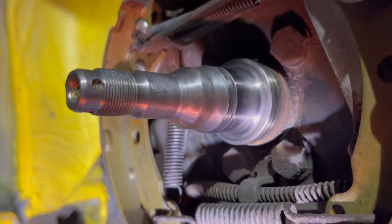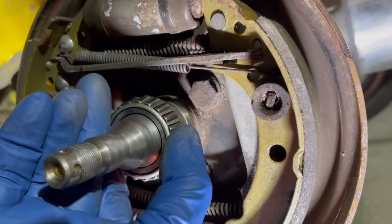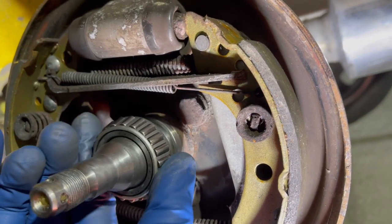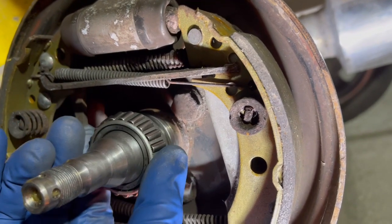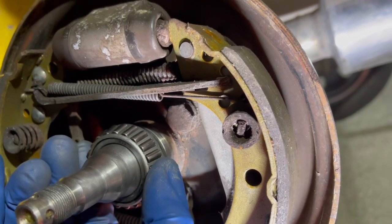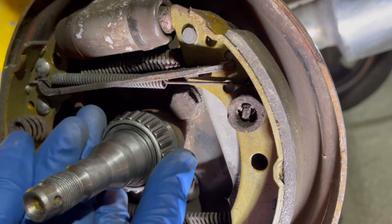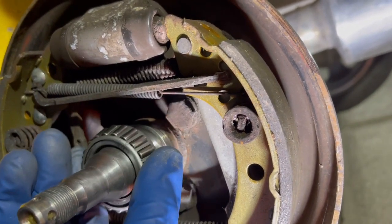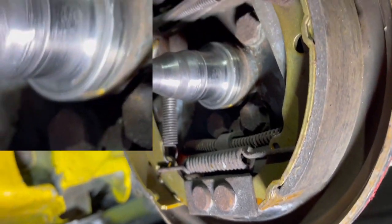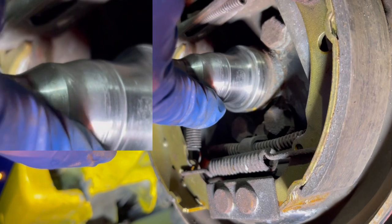It's pretty fine grit so it's not taking off a lot, but it's polishing the surface. We're just about there. It's dragging a little bit just right here, but for the most part see how it's going on and off — just one little spot. If I tilt it at an angle it'll grab, but if I keep it nice and straight, this is how you want the bearing to be — smoothly gliding on and off. You see that little light line right there? That's the lip that it's getting caught on.